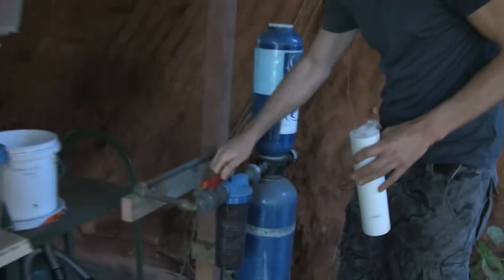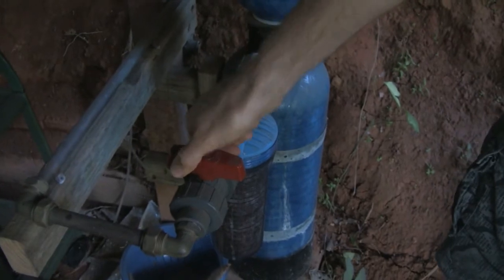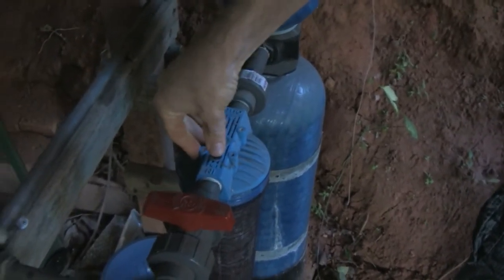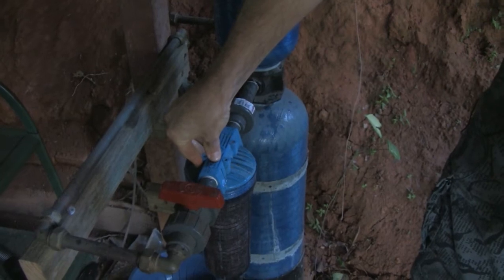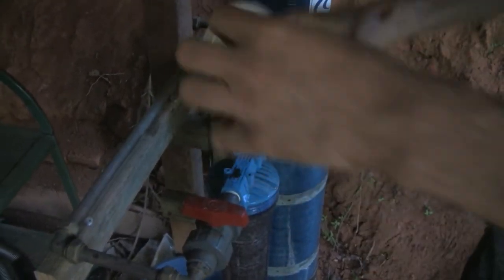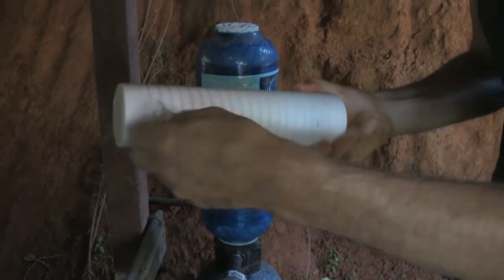So if we come over here, I'm just going to turn the mains water pressure off. This is a pressure valve here, so I'm going to push this — it's probably going to let a bit of water out, might get a bit wet, it's under mains pressure. Okay, that should be good to go now. Let's take this out of its packet — they're not expensive, these pre-filters. It's a five micron filter.